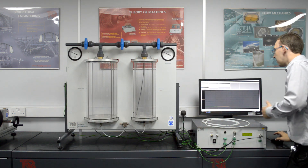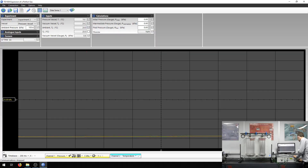If we go back to our software and pause or stop the communications, we can go back and look at that trace. Our main measurements are the initial pressure and the lowest pressure we measure. We can enter these using the cursors, and we see the value at the bottom of the screen. Our initial starting pressure is 29.74. Then we use the cursors again to find the lowest point — scrolling back and forth — and we obtain 2.84.